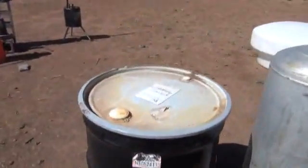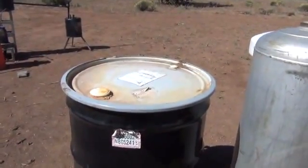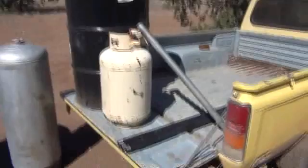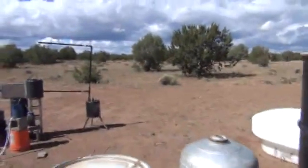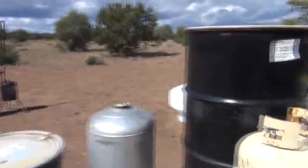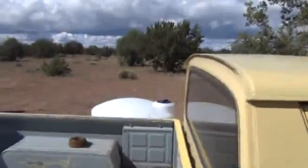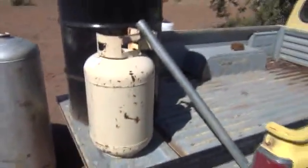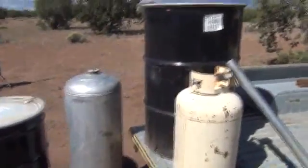You see the second barrel here. That second barrel is going to be for our hay filter system at the very end, right before the gas goes into the carburetor — completely packed full of straw. That'll help the final drying process after we've run it through all the condensers and radiators. Like you see over in the other project in the background, those condenser jugs — I'll have a few of those sitting at the bottom peaks of the radiator system running above this bed. The radiator system is actually going to be bolted down across the top of the bed line, all the way down on both sides, sitting as high as the cab, slightly pitched in — a big two-inch pipe radiator on both sides. That'll make sure our gas is well below the dew point. And if more cooling is needed, I'll cut up the black pipe and make a radiator tailgate out of it.